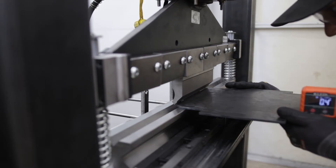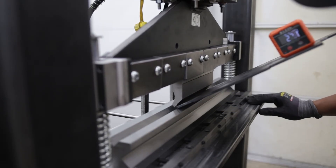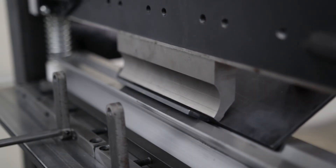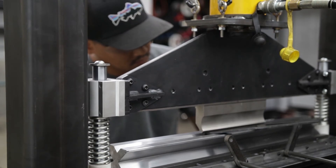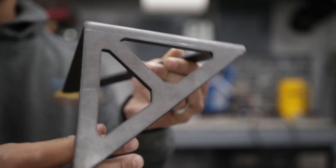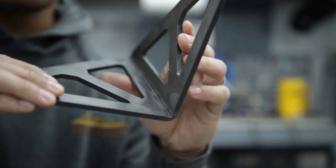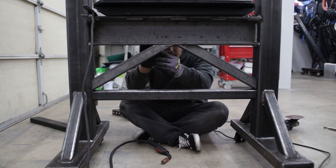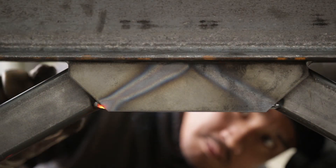Let's do some bending. I had to make a pump tray and a mount, so this was a good opportunity to see the press brake in action. This is 3/16-inch thick steel, and I'm excited and impressed by the result. The inner bend radius is tight and the bend is uniform throughout the bend area. To get a 90-degree bend, I used a magnetic digital angle finder and bumped the pedal until I got close. To make the frame overkill, I added some diagonal supports, then plate welded the connections, jigged up the pump tray and welded that in, then installed the hydraulic pump.